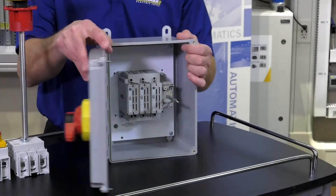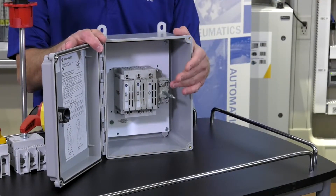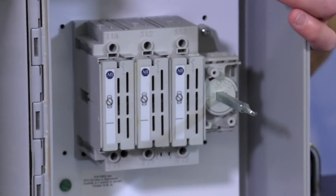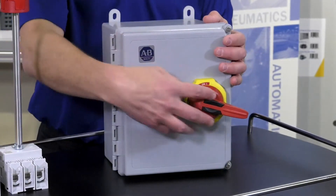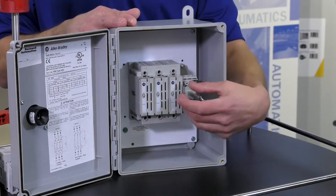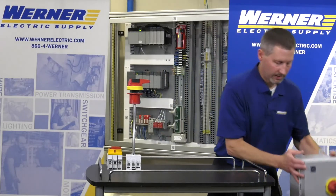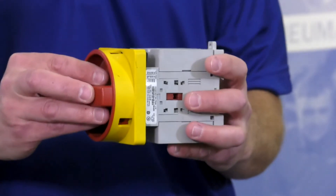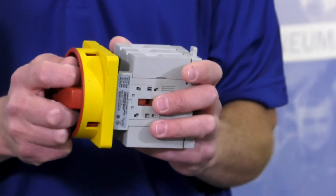Another similar product that we offer is the 194R. The 194R is a UL98 disconnect switch as well, so it can be used for an entire panel or an at-motor disconnect switch. This is a non-fused version, just as the 194U is non-fused only — and as you can see, this one is mounted in the enclosure to the back panel with a handle on the front for turning it on and off. The 194R is offered in a fusible version, so if you do need fused, you'd have to go to a 194R. The 194U is only non-fused, as is the 194E. The difference being UL98 for the 194R and 194U, and UL508 only for the 194E — making it only suitable for an at-motor type of disconnect or load switch.